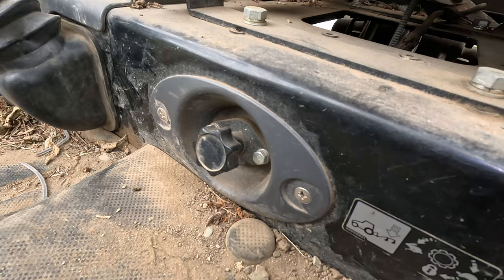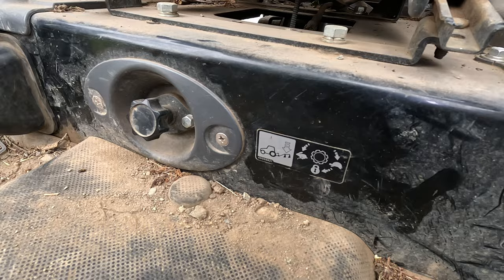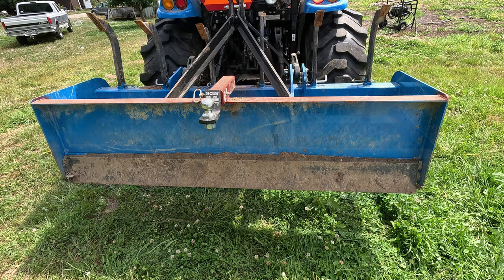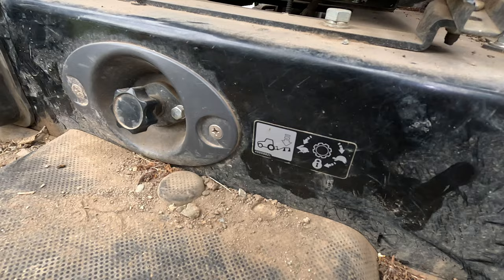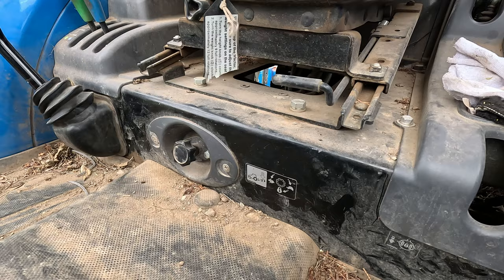Last but not least — we were looking at the three-point on the back and saw the lever to raise and lower it. This is supposed to signify that you twist this to increase or decrease how fast your three-point will drop. You turn this all the way left towards the rabbit and your three-point will drop fast. You turn it towards the tortoise, it'll drop slow. That's so if you have something heavy on the back, it doesn't instantly crash to the ground. You can also lock it if you turn it all the way over to the tortoise. A lot of times these get bumped and get locked, and people can't figure out why the three-point won't drop — that's why it's located under the seat between your ankles.